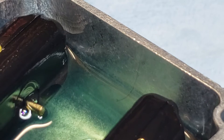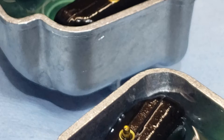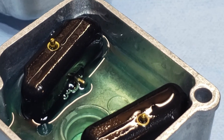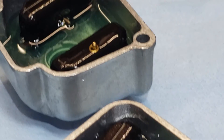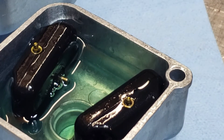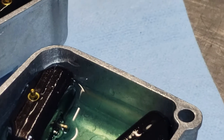Last night I added fuel to the machine, filled the carbs full, and primed it up — didn't try cranking or anything, just primed it up and got fuel in the carbs. I went on doing a couple other things, was going to come back and check the fuel lines for any leaks, and I came back and got a puddle of fuel on the ground. I was trying to figure out where it's coming from and it's definitely the carbs. I checked deeper and this is what I found — you can see the line on the front there.